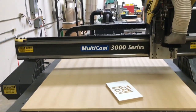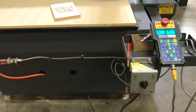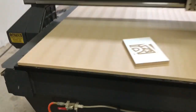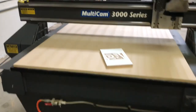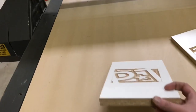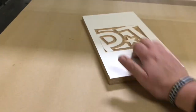We're going to take a quick look at the vacuum system now. The 20 horsepower PD pump is in the back, piped at the bottom of the table. We've got a one-inch phenolic vacuum grid with a spoil board on top that's been freshly machined — that program is automatically created with the machine. We'll go ahead and turn on the switch. We'll take this piece of melamine, about 7 by 12 inches, and throw it on the table. Instantly stuck.